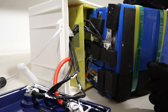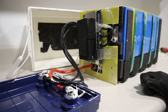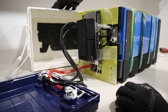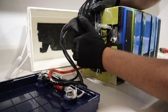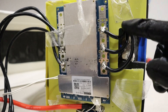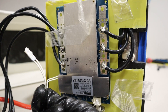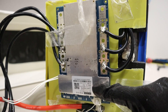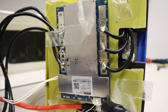I was able to tighten up that loose connection — the positive one did not move at all. After getting the fiberboard box out, which was double-sided taped to the bottom, I could take a closer look at the BMS. The main negative leads are soldered on, there is a high temp sensor attached to the batteries — which is good — but there is no low temperature sensor. The label confirms it's a 100 amp BMS, and the individual voltage leads go to each battery module and are glued in.